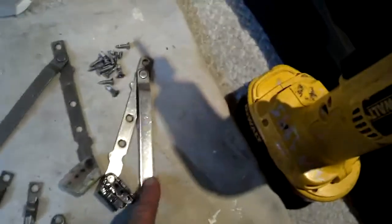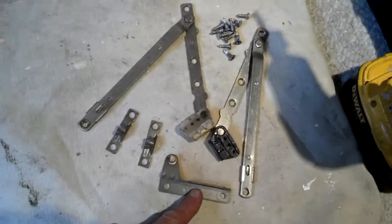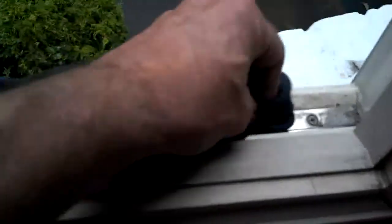We're laying down the old sash on its front and I'm going to bring it in and lay it right on top of the new sash. The frame is very dirty because someone had sprayed WD on it, so I'm going to get in there and clean up the entire inside of the frame and the tracks — really well — with some all-purpose cleaner and a soft wire brush on the metal parts. Here's the hardware we removed: the two shoe brackets, the two locking clips, and the one retaining lug, plus all the screws saved. These Andersons clean up really nice — they're made to withstand years of weathering.